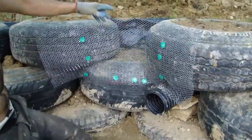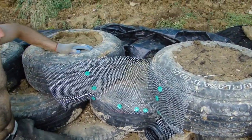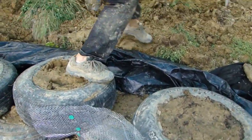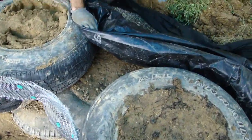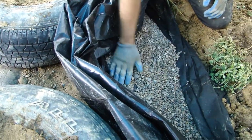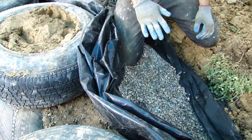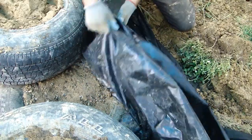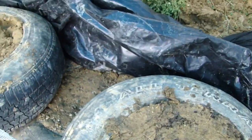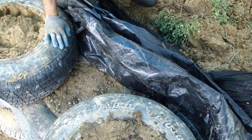Now our lath is secured nice and strong. On the back side we're going to use a form made out of our backfill. You can see from an earlier video we talked about the French drain — that pea gravel is our backfill behind this tire wall. As it rises it holds up the back of the plastic, and when we pour our concrete it'll form against our pea gravel backfill.